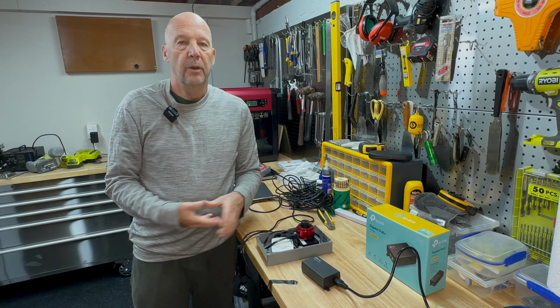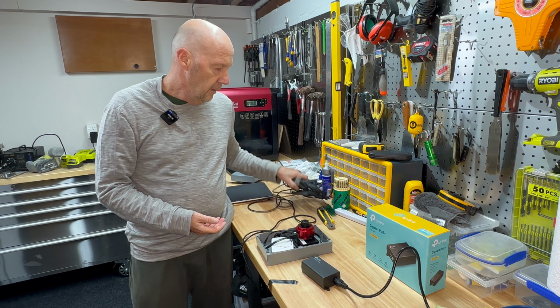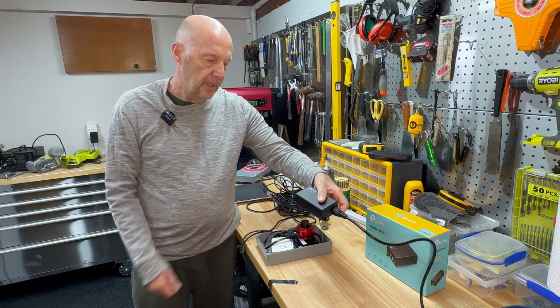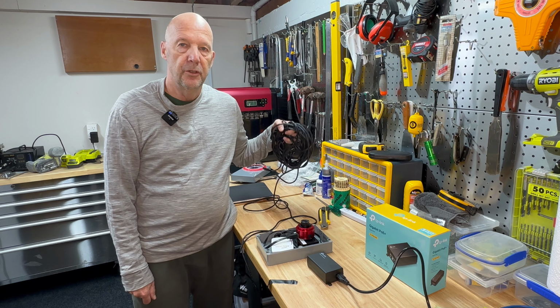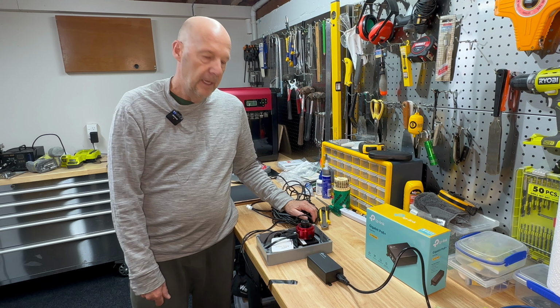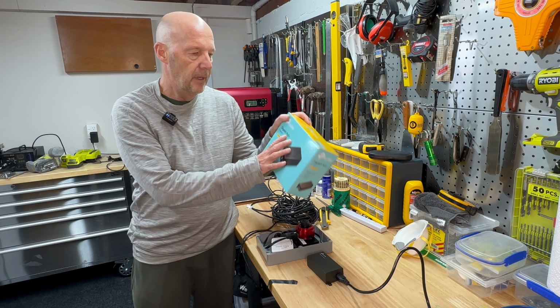Okay, so as I said, just a quick video to show you the little change I've made to this, and I think this will be a lot better, being able to run a long cable like this, and I can have the actual power injector here for the Ethernet cable well tucked away inside, and won't have to be running a 240 volt power supply outside. I think it'd just be a lot more safe, to be honest. So yeah, consider that if you want to set up your Allsky camera, that the power over Ethernet is working well, particularly with the new version of the Pi Hat. But just remember, you've got to have the POE plus. It's got to have the plus symbol.